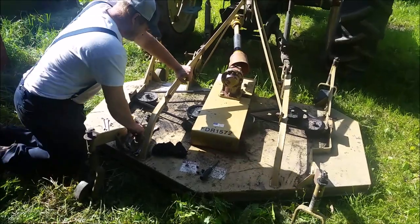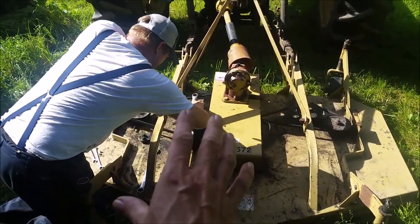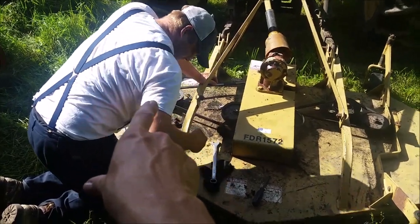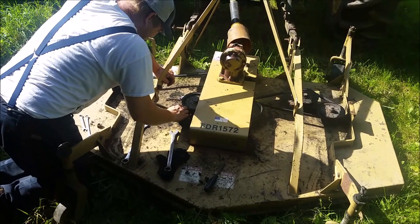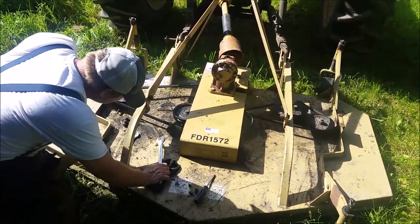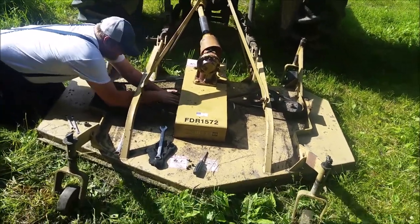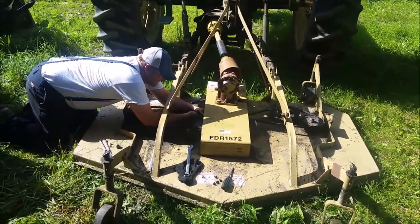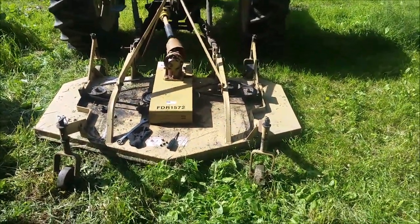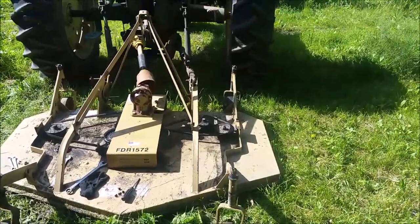This guy said I was having to push too hard on this pivoting arm, and when we were getting to the tall grass it should have been able to release and adjust its tension with the spring. When we started, the pivot the spring attaches to wasn't moving well, so he's going to take this apart and get it lubricated with some good grease — because maybe that's what made the belt jump. He thinks it might even be frozen right up. He was able with two hands to give it a shove; it seems real stiff in there. People tend to believe that buying used equipment means buying somebody else's mechanical problems, but not everybody is as mechanically inclined.